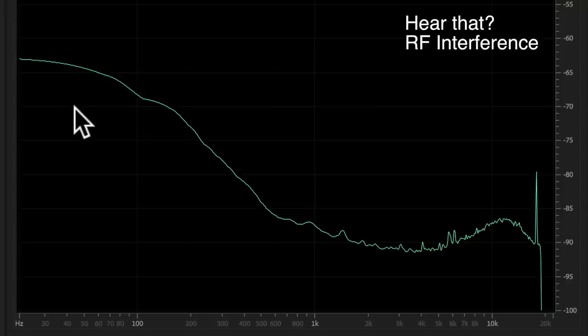Overall, in terms of self-noise, the Rode VideoMic Me-L does a pretty nice job. Using a high-pass filter in post, we could actually clean that up quite nicely. The two biggest things that make this different from your phone's microphone are: first, it has a much larger half-inch capsule, and second, it has a cardioid polar pattern — it's most sensitive on the front and rejects sound from the back. Whatever you aim it at is mostly what it will pick up, giving you better isolation and more focused sound.